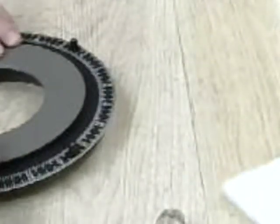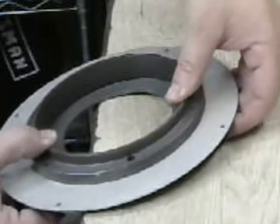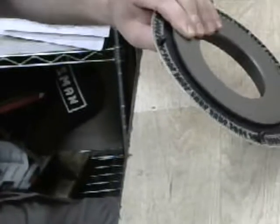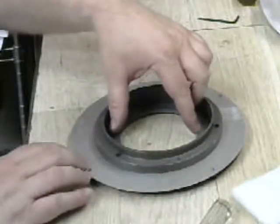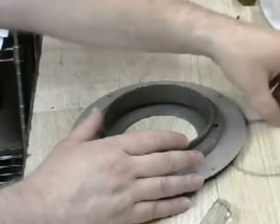And you have to do all that. Then you have to take this whole assembly and flip it over, okay? And the trick is you have to put it on the edge. The reason being, the setting circle has these screws sticking out, and they sit too high. So if you just put the whole assembly down, okay, so you have the whole assembly with the spring in there. If you just put it down, then what will happen is the center part can fall away and you lose your spring. There you go. Before you have a chance to get the screws in.